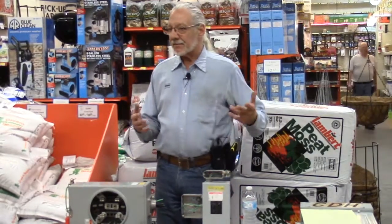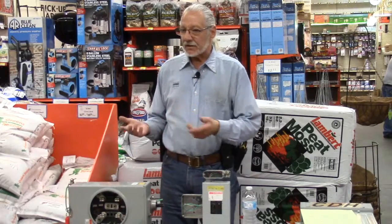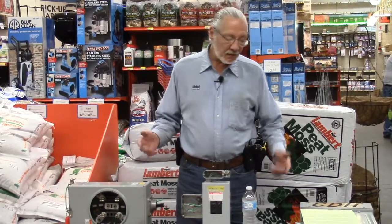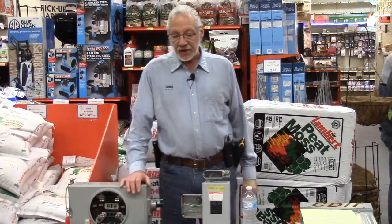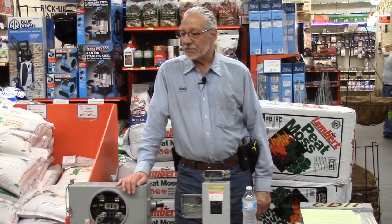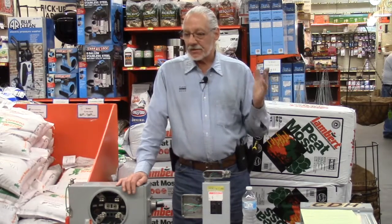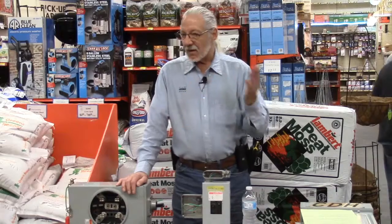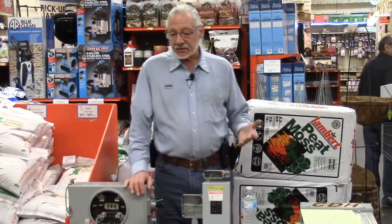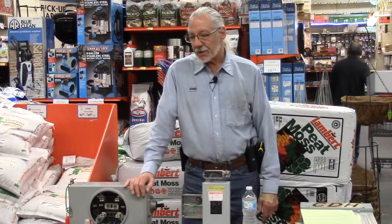And you start adding things together, and people say, well, I keep blowing the fuse in my kitchen because the microwave is plugged in with the refrigerator. Yep, you will blow the fuses, because modern microwaves, especially the big ones, take a lot of power, and your refrigerator is almost maxing out a circuit. So when you combine the two, you go over. If that microwave's on and all of a sudden the compressor of the refrigerator kicks on, which it does alternately, every couple of minutes or so, if you happen to be using a microwave when that happens, you pop the circuit. Now everybody says, well, okay, can I put a bigger breaker in?